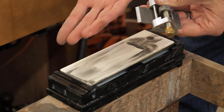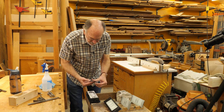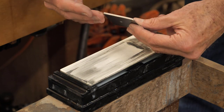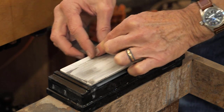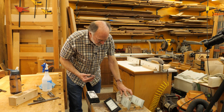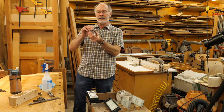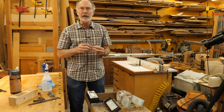That's nice and smooth. I can feel a little bit of a burr there, so I don't want to set this flat — I want to hang it off the edge because it has a slight bend to it. I just want to get that burr off the back. I'm going to check and see — put it up against the blade and make sure that I can't see any light from under there. I think I'm going to be in good shape. Ready to go.